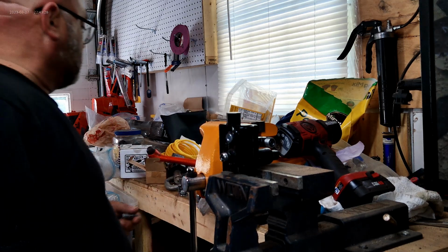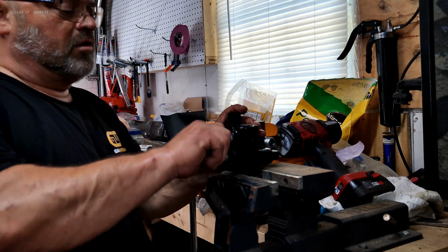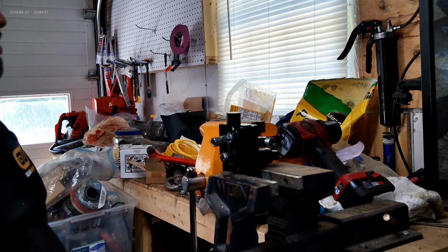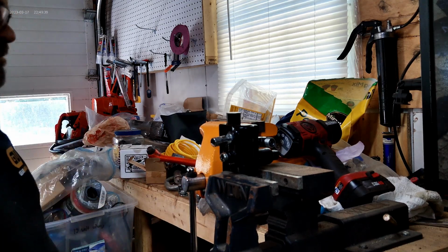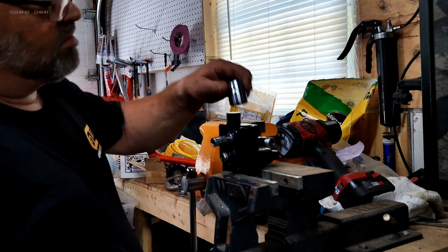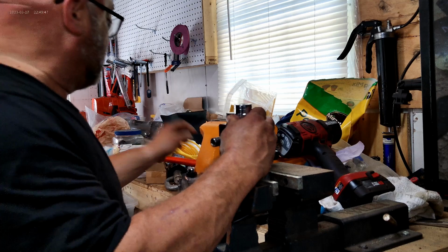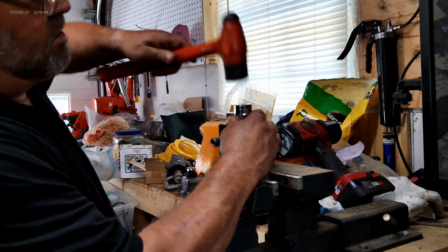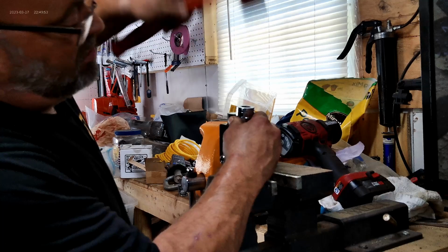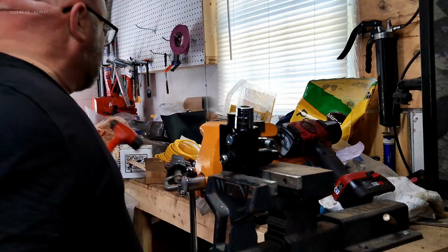I don't want to do this with a gun. Yep. Great. Then this is an O-ring, so you're going to just snug it. You don't want to over tighten these. It'll actually cause it to leak. And then while Paul's getting that, you're going to take a 1-inch socket, put it up on this nut. It's going to fit a little snug because of the paint, and you're going to want to pound it in. And make sure that it's tight.